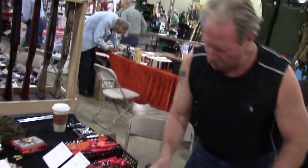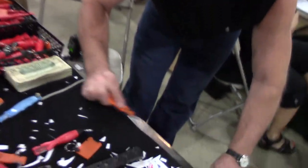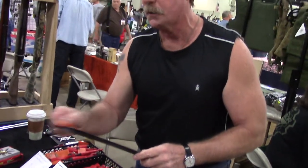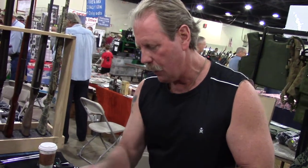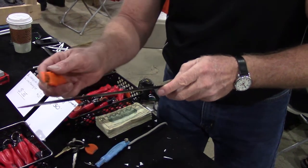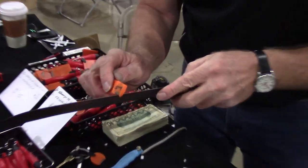What I'm going to do is just set it down and brush from the tip around the radius. Turn it over this way, that way. Brush light. Don't push too hard. Let it work. Don't make it work. Slide it right down the blade like this. Never press very hard. Let it work. Don't make it work. Do not carve forwards.